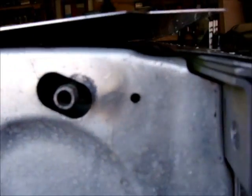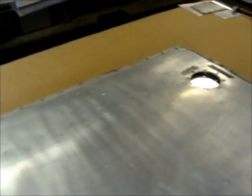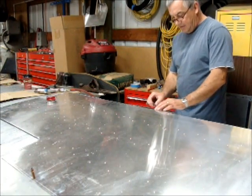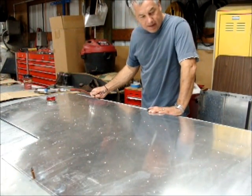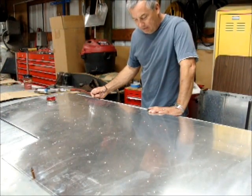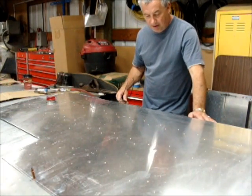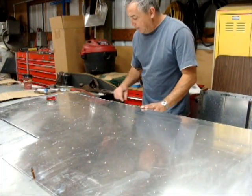...drain and your vent. The drawing says you overlay your new tank lid with the old one — you can do that if you've hole-found a few prior. If you do, make sure they're holes that don't move; for instance, that root rib will move in and out, so you wouldn't use those — you'd use some corner ones. I actually opted to hole-find these instead of laying the old tank cover over this one. That just adds one more variable, and at this point I don't want any variation. The old tank had some holes that were wobbled out, so hole-finding each one and Cleco-ing it in place — once you get a couple established to hold it so it cannot move — gives you a much nicer, cleaner job.